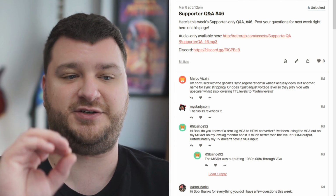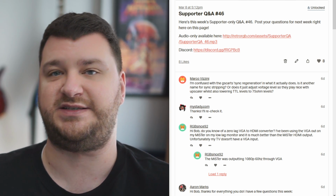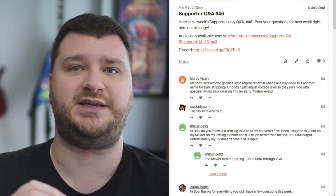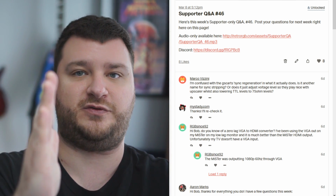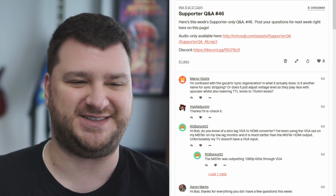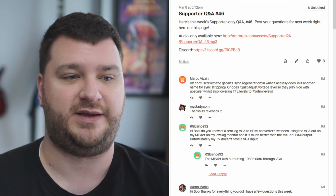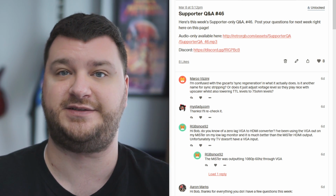And just to answer your question directly without all of that rambling, it's different than sync stripping because it rewrites the signal in real time and doesn't strip and then just spit out something else. One other bonus too is there's a slight delay while using original sync strippers that causes the entire screen to shift over just one pixel if you're looking at it on a digital display, because we all know that CRTs don't have pixels. Whereas sync regeneration is done in real time, so there is no shift. It is the exact same location on the screen that it would have been. So I think that covers it all. Hopefully, ask me again if I didn't explain it right or if you need anything else.